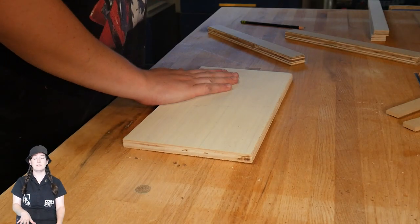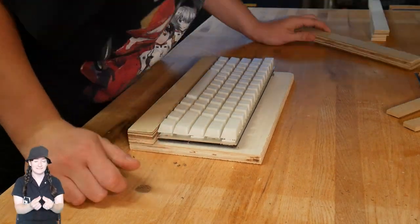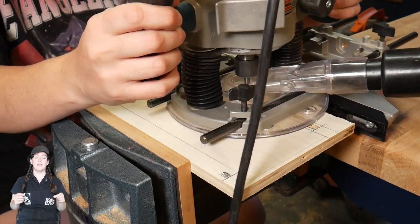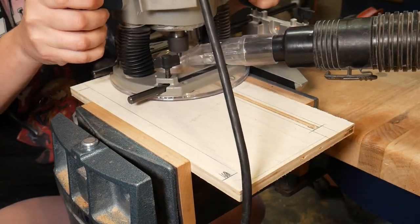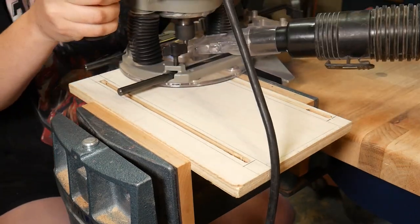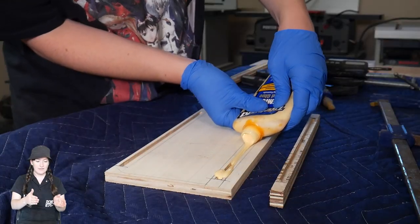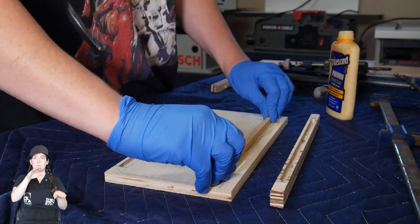Whereas plywood has the benefit of all those overarching layers, you know, laminating against each other, protecting it a bit better. So for the construction of this, I started with a plywood base, and then I used floating mortise and tenons, which are basically just long strips of MDF. So I cut those recesses in. Set in the MDF strip and then glued on these front and back pieces.